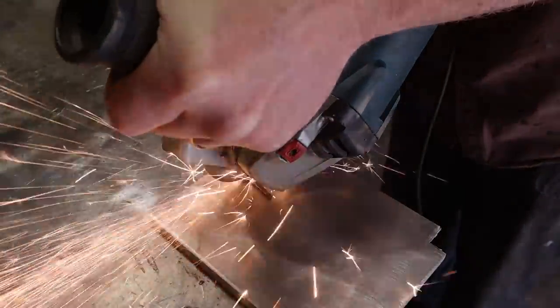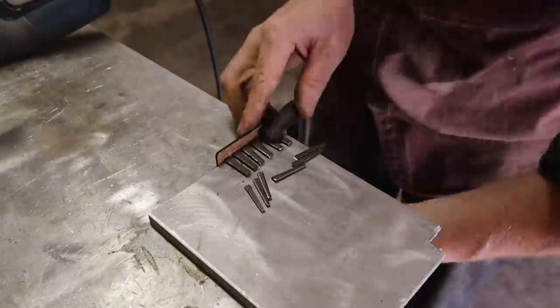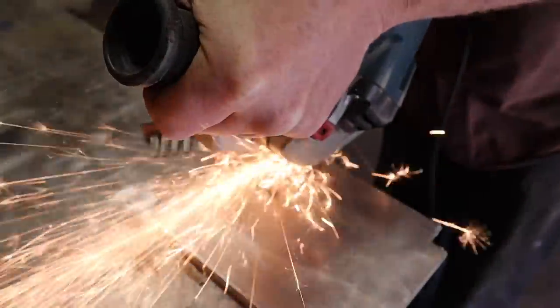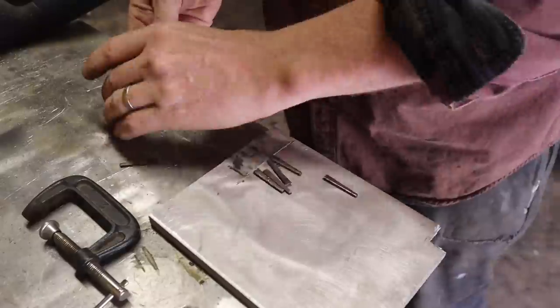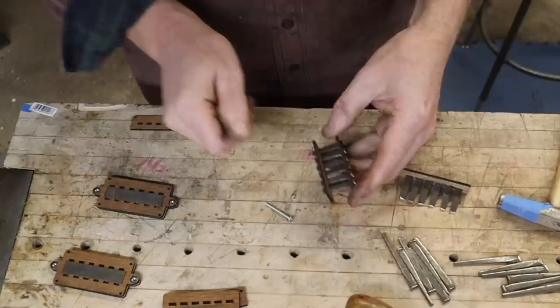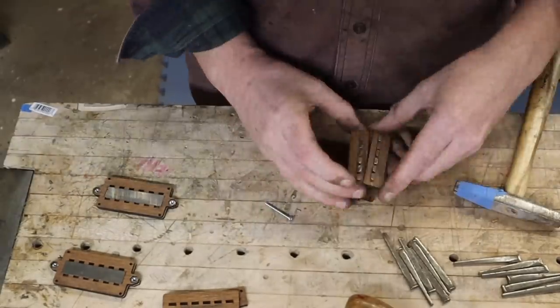I did the same thing on the bottom bobbin, making the holes even smaller for the taper but tight enough that I'd have to pressure-fit it into place. This took care of all the inaccuracies and differences in the nails. They also had to be shorter so the pickup would fit inside a guitar, so I drew a line and set up a little jig to cut the nails shorter. The wood is pliable enough to bang the nails in and get a nice tight pressure fit without splitting, because it's plywood.